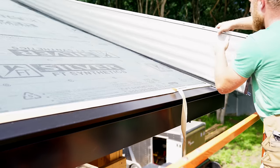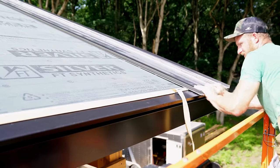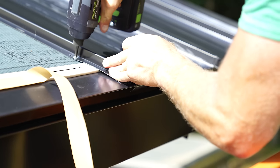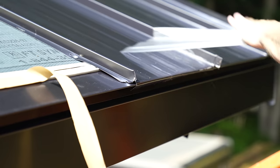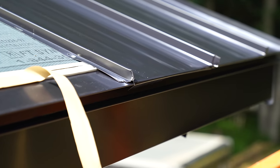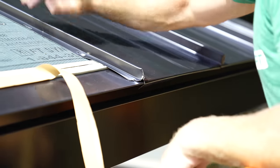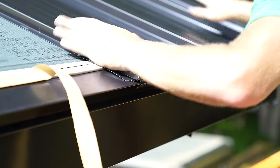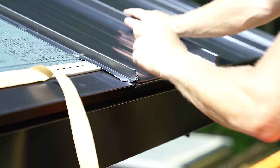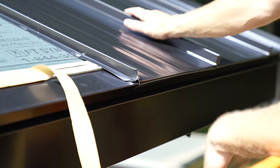Now we're going to lay out our panels 16 inches to edge so we can stay consistent and square. Make sure it's up all the way - right on my 16 inch mark. There's nothing better than standing seam roof. Now that we've got our first couple on and we know everything is looking good, we can go ahead and make up the rest of our panels just like this and start installing them.